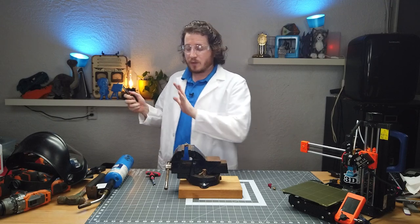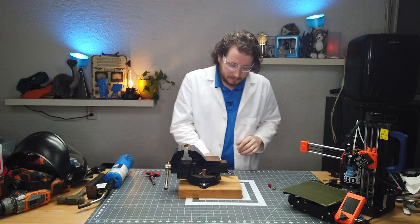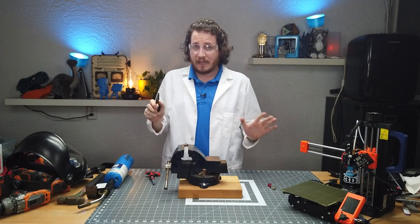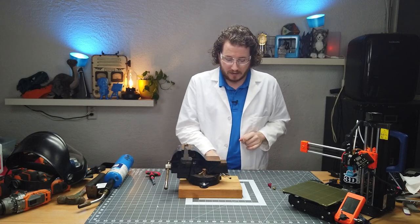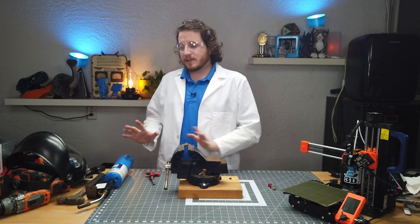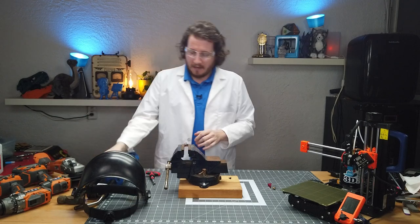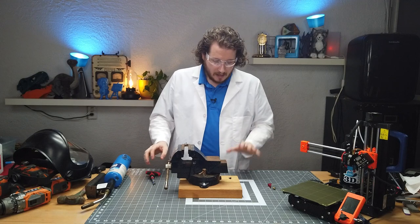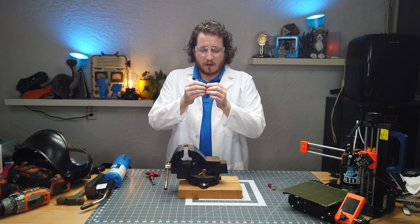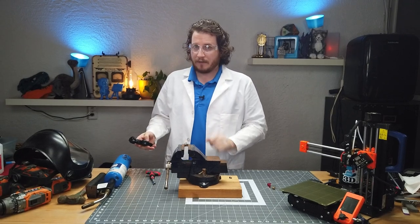If you use a nail set that is also hardened, you're going to damage it — you need to use something softer. You can use files; if you don't know, just go for it. It's trash to you anyway. Also recognize: I put a lot of heat onto this hardened nozzle — I've likely annealed it quite a bit. So this hardened nozzle, I would not trust it anymore as a hardened nozzle. I would not run carbon fiber or anything abrasive through it. But as a regular nozzle, assuming the threads are okay, it should be fine.